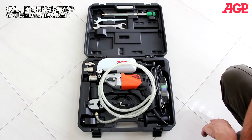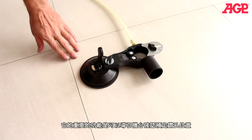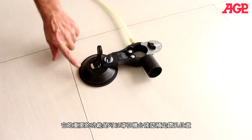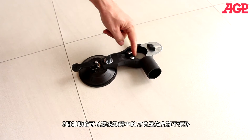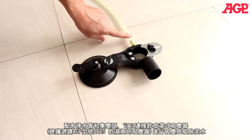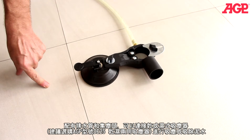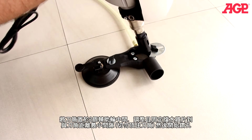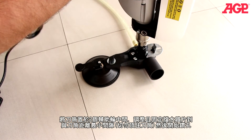The case neatly fits everything including all optional accessories. The suction centering guide is a unique accessory with two purposes: one is to guide the machine and allow you to control exactly where it starts. The suction cup simply attaches to the workpiece and holds it steady. These two rollers will give you a surface to rest your bit against so that it won't wander. It has the drain hose and you can also attach a wet and dry vacuum cleaner to control the slurry. This is the splash guard which adjusts to match the diameter of your bit, minimizing splashing while you drill.